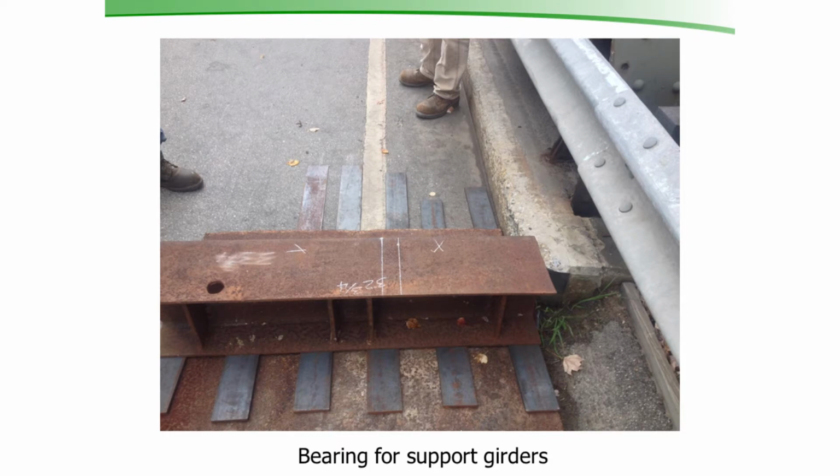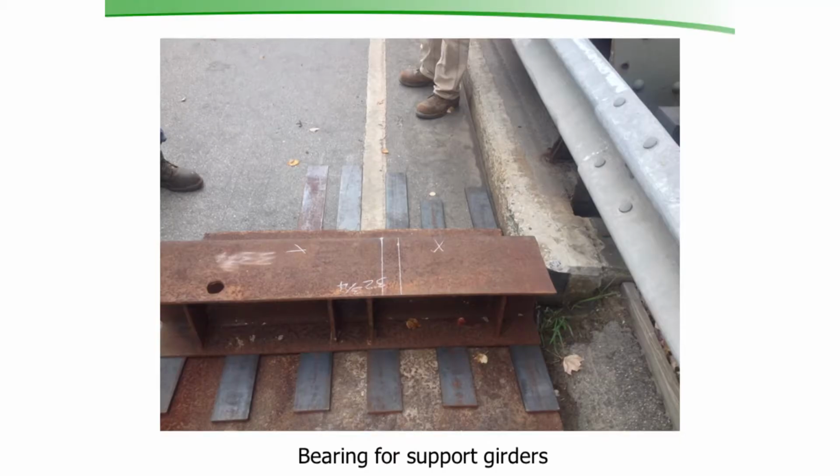We had to be kind of precise in where we're going to have these because we needed to know where to drill our holes for the rods we're going to hang the bridge off of. You can see our holes, we're going to end up right on this side of the white line. This is where one girder sits. The girder sits here. Those rods are going to hang down in this area.